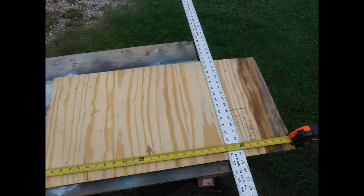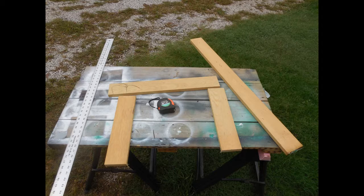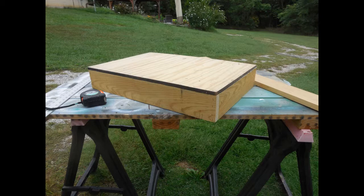Now you want to make a top for the tombstone. Measure the top of the shelf, then cut a wooden top from the scrap plywood. When you measure for this wooden top piece, be sure to allow enough on each side and on the front for the wooden trim pieces. I used half-inch by four-inch trim, so my measurements were 24 inches by 16 inches. Then cut out the wooden top. Measure and cut the trim pieces: one for the front and two for the sides. My trim pieces measured two feet for the front and 15.5 inches for the sides. You can also use half-inch styrofoam for the top and trim, though this will add some cost. Your trim pieces for the top don't have to be four inches wide — I have made tombstones with slightly narrower side trim pieces.